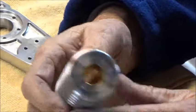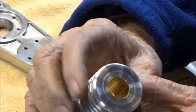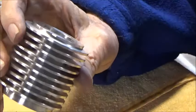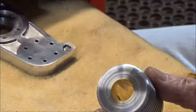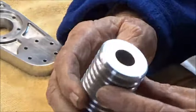I'll probably put gaskets on these anyway. I checked this with a square — it looks perfect, so it may be just fine. I didn't check this one; I just parted it off. But I did set up the parting tool nice and square, so hopefully it came out good.